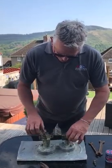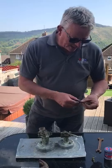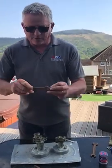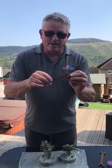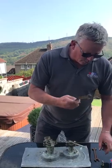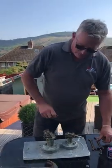So the servicing of the valve is quite simple. First of all, you need to get a 5/8 spanner. Please try and get a 5/8 spanner if you can, because it fits the bronze nut's shoulders without slipping around on the sides. If you can't get one of those, a 16mm will just about fit, but there is a bit of play in it.